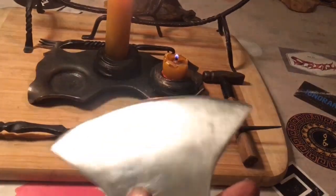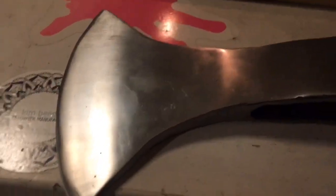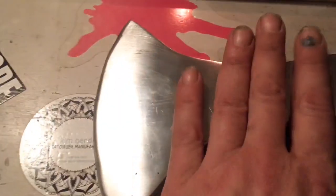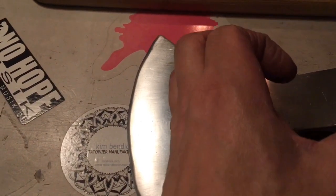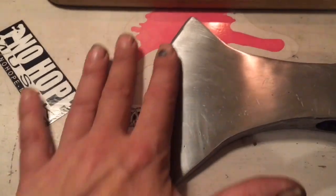On part 3 I will show you how to temper and harden the blade. As you may remember, there is a fire weld inside here. The next step is heating up, quenching, letting the temper colors come, and quenching again at the right color when it arrives on the edge.